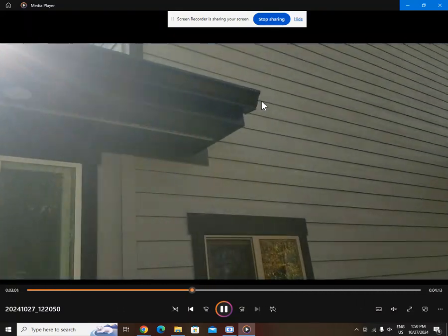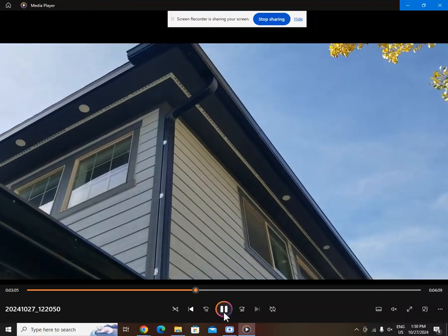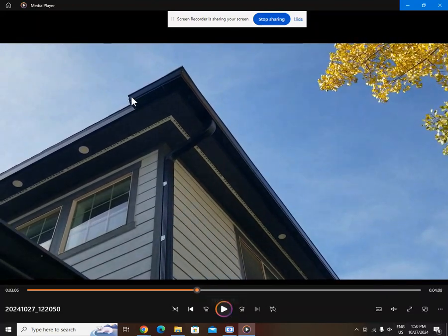That was when I did the box miter — the same thing on the valley. On your end you want to run your end past the roof so it catches the water. Up here I stopped my gutter short because there's no point putting a rain gutter over that section — it's just water from the higher roof falling on the lower roof. So I saved a little bit of money and time right there.